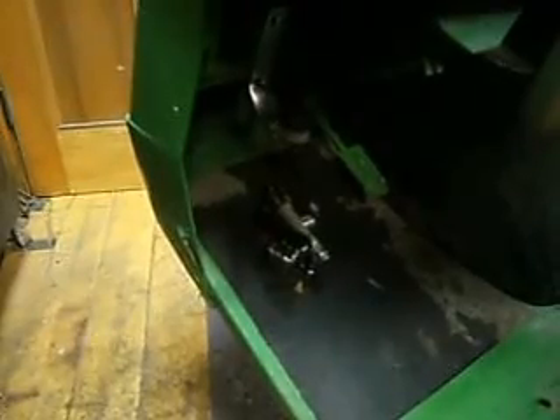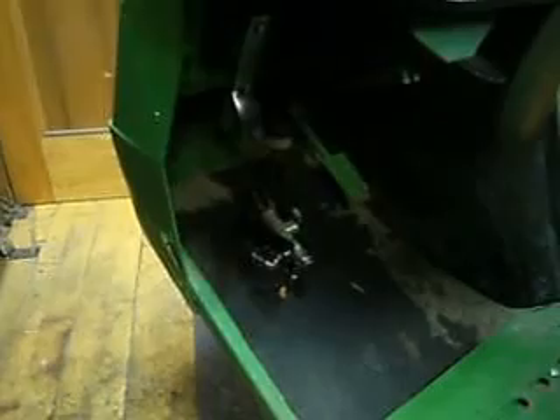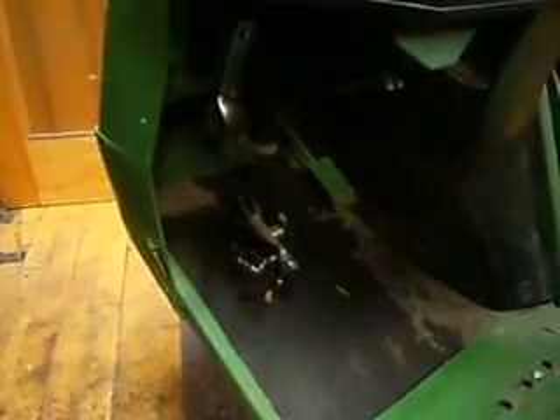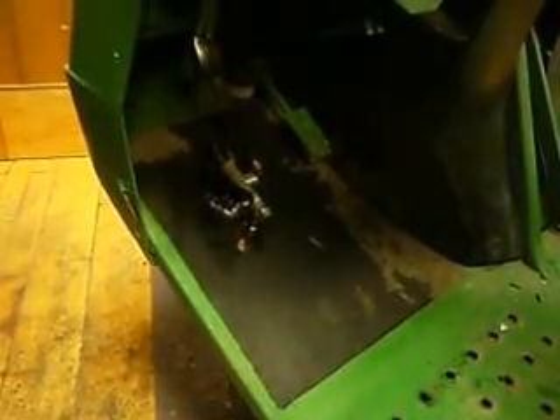If you're in the same dilemma with one of these John Deeres — a lot of them got junked because of the brakes, you can't replace the parts — find a quad with front disc brakes and all the equipment should fit. Make sure it's got a foot brake on it and you'll be set. I used a 2000 Polaris for this one and it worked real good.